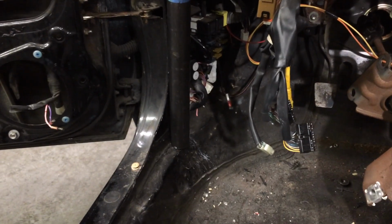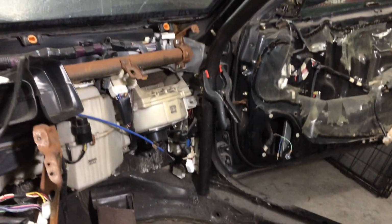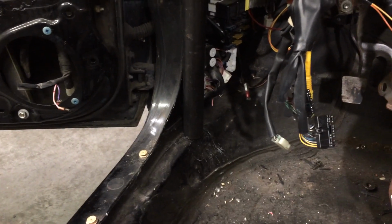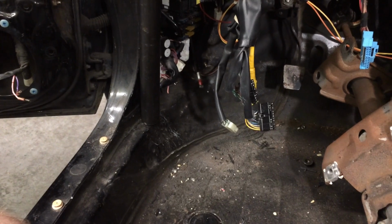Alright, so I got both of my main hoops now fit in here, and this is where it's sitting on the frame rail there, and the same as on the passenger side. So the very next thing we need to do is make mounting blocks or boxes for both sides of this, and then once I get that done, I'm going to come up here and we're going to work on the windshield hoop from point A to point B. So we'll put that in there. We'll make that out of some 1/8 inch plate when we'll start with our cardboard cutouts.